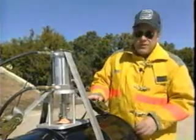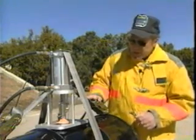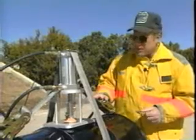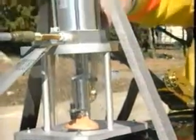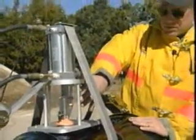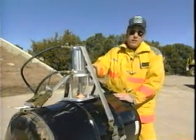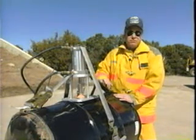This device is lightweight, can be operated with ease by just one person, and in case we have a catastrophic failure of the container, you are at least 150 feet away from the device when it's operated. When working with flammable or combustible materials, an inert gas can be injected into the tube, and this reduces the likelihood of a fire or explosion. So when dealing with pressurized drums, we recommend that you use some sort of remote container sampling device such as this or projectile type operation.